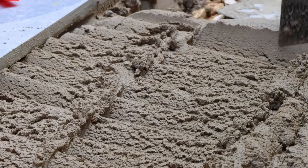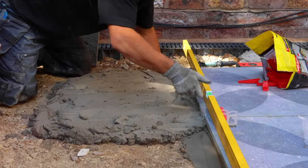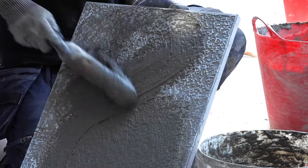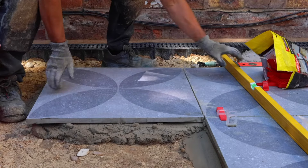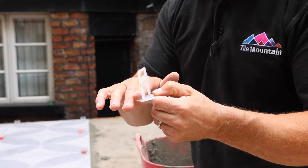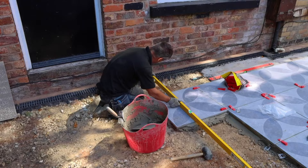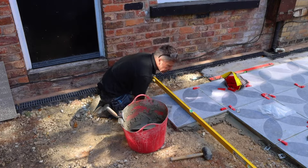We just want to spread the mortar all out here. I can still use my tile levelling system in there. I'm going to place the tile down on top, which has already had the primer on the back of it. These are the wedging clips — the way they work is they go underneath the existing tile and then the wedge gets placed in and it lifts them up. Of course, always checking that I've got my fall into my drains there, which is very important.